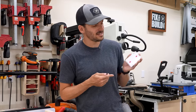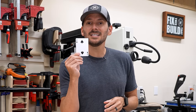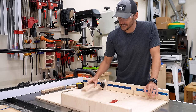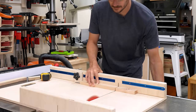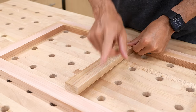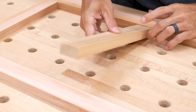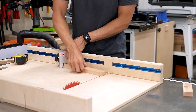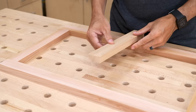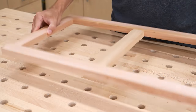To fix this we'll use the disappearing gap trick. Both the two of diamonds and the two of spades are ten thousandths of an inch thick, and we can use them as a shim right on the stop block. I've got a new piece, reset the stop block at just over 11 inches, and make the first cut. Just like before we're a little long, so I add one playing card to the stop block and make the next cut. I keep adding cards and making cuts until I get that perfect fit — two cards was just right. No more gaps.